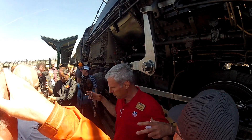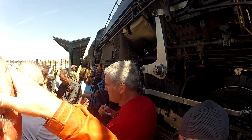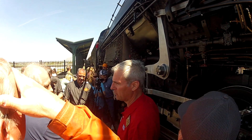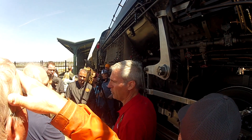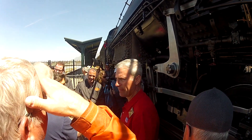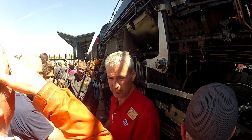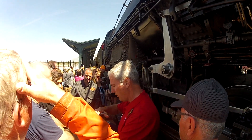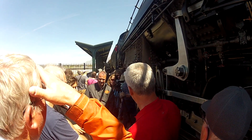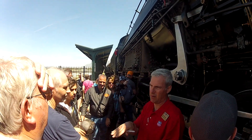We have a big giant wall in there, and it's the same thing in the 844 — we modified the original wall that they had. We designed it so it's got a proper arrangement. We had to cut a lot of brick to get it to fit. It's made with a special refractory cement — it's all molded in, with one mold shape and then staggered courses, kind of like making a fireplace. We just put it all up in the middle.